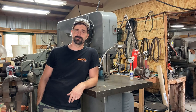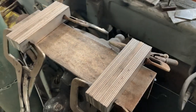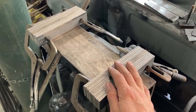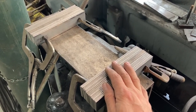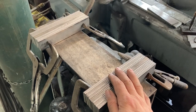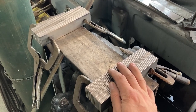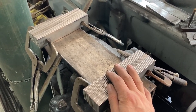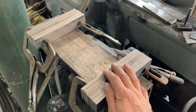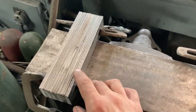Here are two billets. I often start a larger chain loaf as two billets — it's just easier to manage the amount of steel that way. If one of them doesn't distort how I want it to, I still have one to work on and can end up with some steel without starting all over. Usually what will happen is I'll weld these together, distort them how I want, then rip them both, and combine them midway during the process provided they both look good enough.